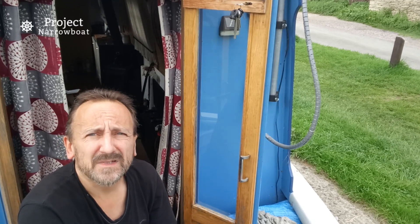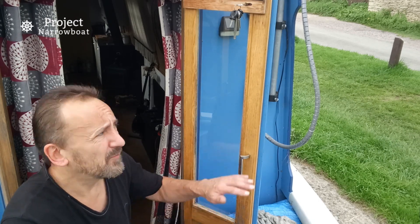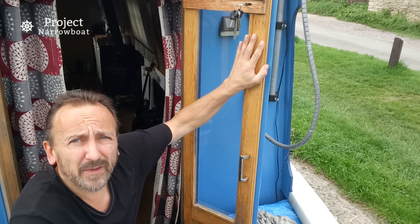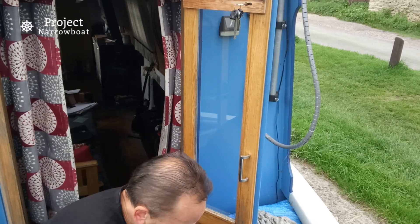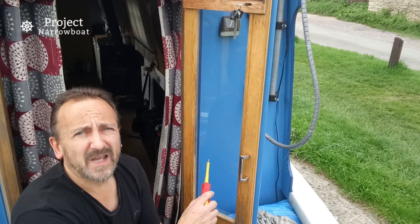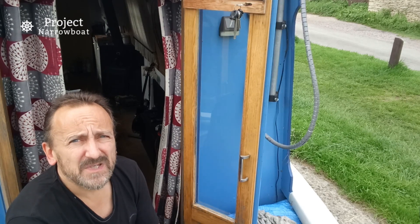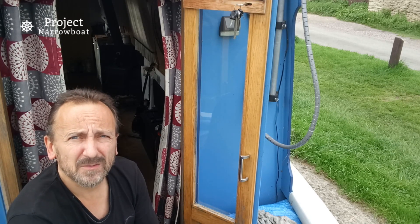Here's a little job I've been meaning to tackle for a while. The varnish on the bow doors has become rather tatty and jaded over the years, and I always wanted to do a lot of woodwork on this boat in white anyway. So what I've decided to do is come out and decorate these doors today. I've got some abrasive paper, I'm going to give them a little sand up, obviously take the handle off, and there's a vent just out of picture I'll take that off to give myself a clear run, then sand them up a bit and apply a couple of undercoats.